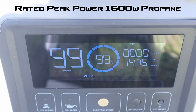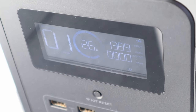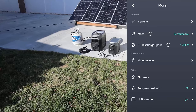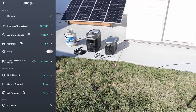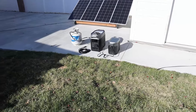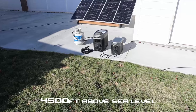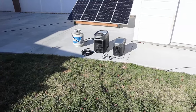The max power on propane is 1,600 watts and we're seeing a little less than 1,400 on the Delta Max. I had to adjust the generator to 1,500 watt output instead of 1,800 watts, and adjust the Delta Max to 1,400 watts instead of 1,800 watts — otherwise it would just cycle at full throttle and come back down. I'm at around 4,500 feet above sea level, which is probably the cause, so you will have to adjust settings depending on your location.